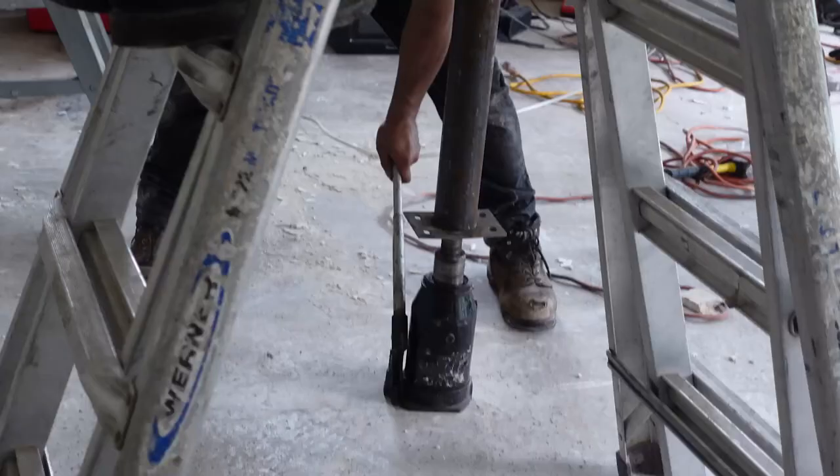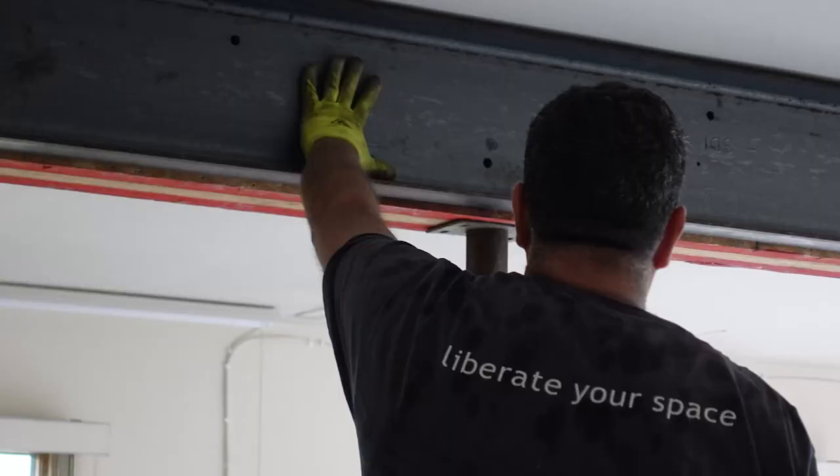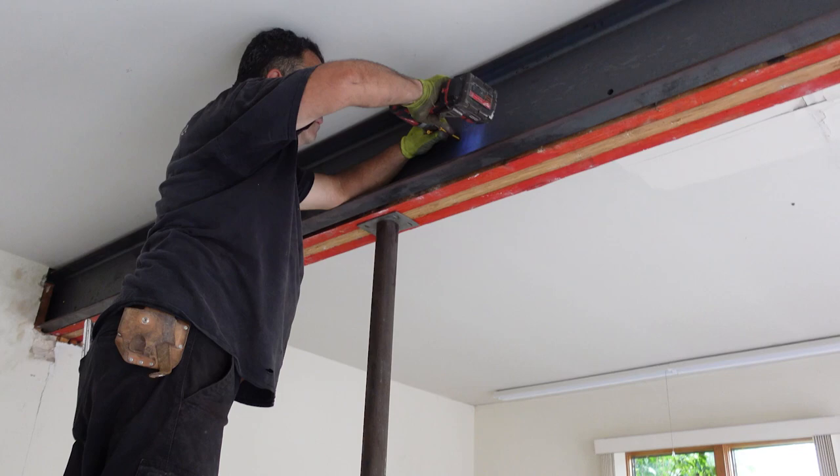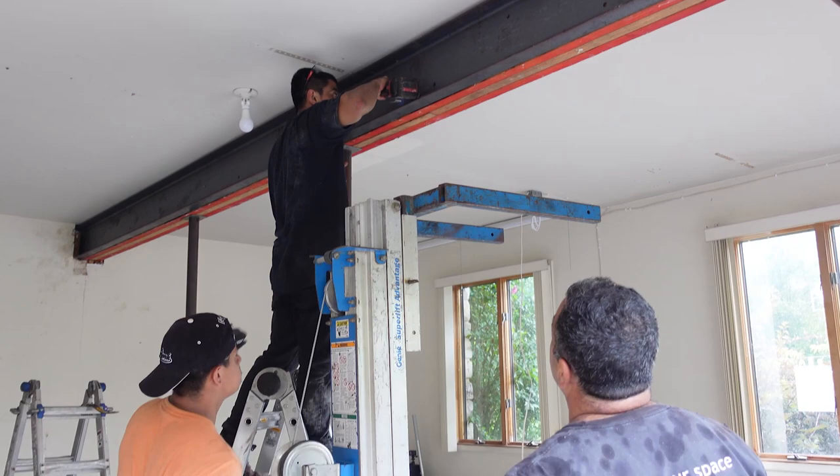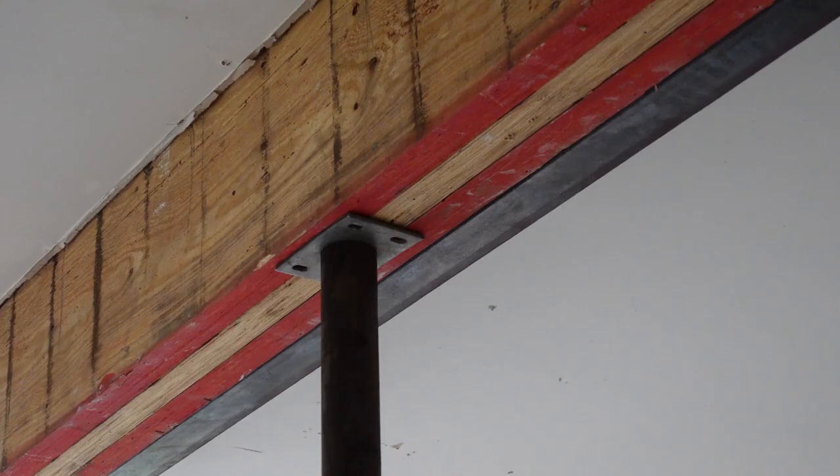After talking it through, I gave the go-ahead to raise up the center of the beam, which looked effortless. If you're ever in this position, make sure you check that all of your windows on the affected wall still open and close smoothly, and watch for drywall cracks, which could require some touch-up repair. I was lucky there was no problem in the rooms above. With the main beam reinforcement temporarily held in place, the half-inch steel flitch plate was moved into position.